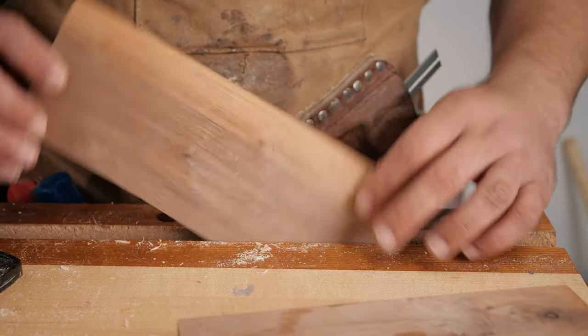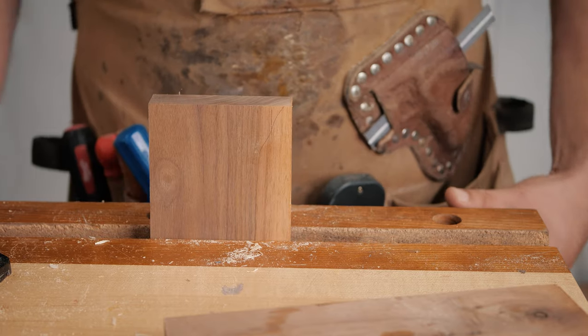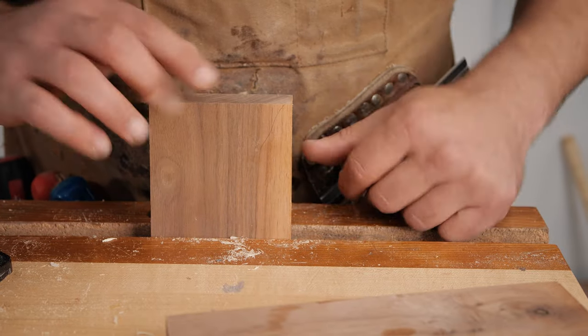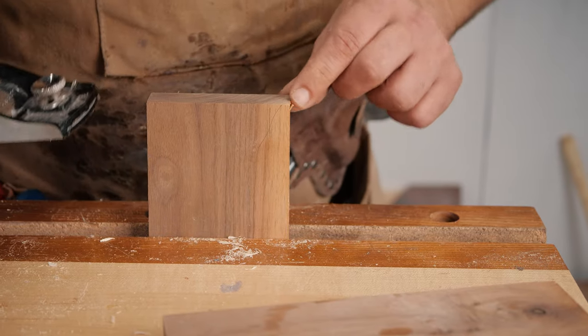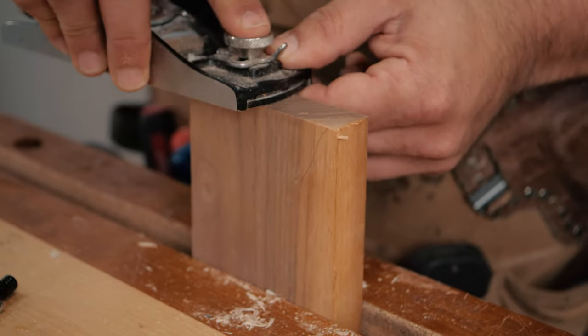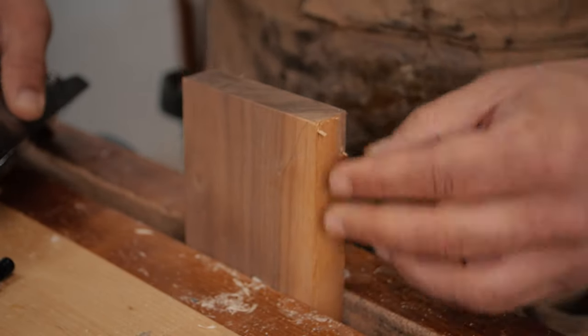But that's not my trick here, because my trick has to do with end grain. When you're planing end grain, you're at a whole new ball game. Because the tree has grown up this way, they're like little fibers or little ropes going up this way. If you plane this way, you're going to get tear out. You can see right here — that's just with one stroke of my hand plane, we got this tear out. It gets even worse when you go from the top. Look at that — that's just terrible.